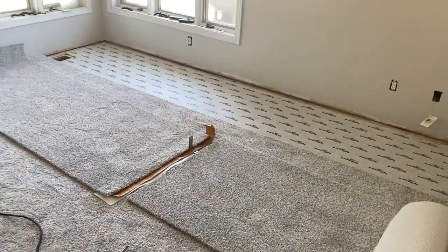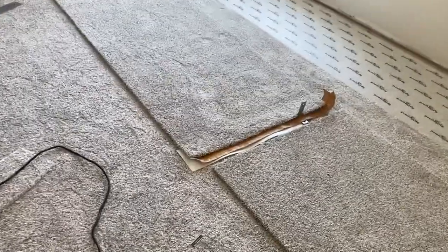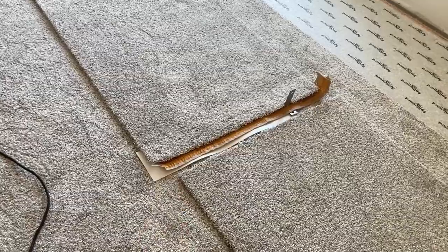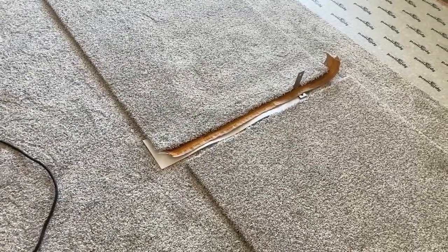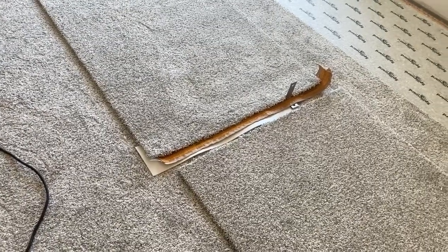We've got the carpet in, and we're getting ready to put a cross seam together, but I just wanted to show you this. Has anybody used that Teflon seam board that comes with the Cool Glide? I'm going to try it underneath a conventional seam iron and see what happens here, because I used up all my seam boards for some shims we had.